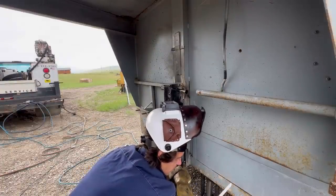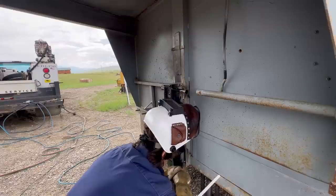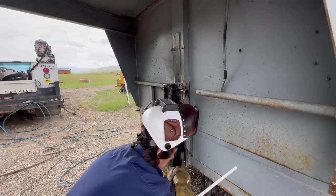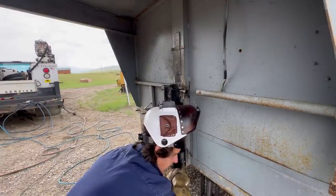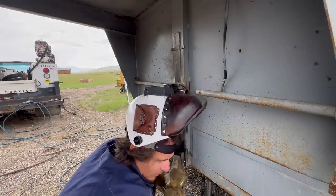In the middle of the tack? No, just start to one side, it doesn't really matter. Okay. Whatever you're more comfortable with. Let it build and then move. You don't really wanna time it, you just wanna watch the puddle build, okay? So I'll watch you, and if I see you sitting too long, I'll say move, okay? All right.